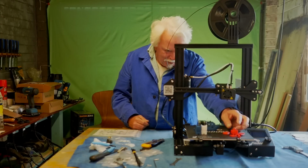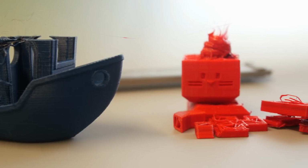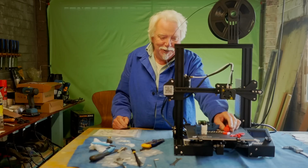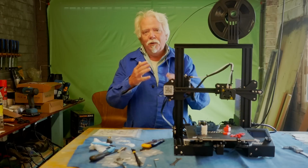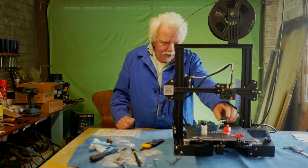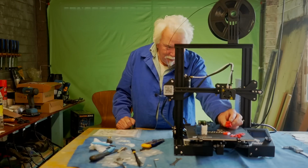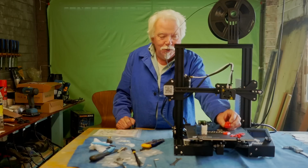I will. And then I got a bit silly, I guess, because some of that sample material I showed you isn't PLA, it's PETG, which I'm not even sure that the Ender 3 can print. I'm sure it can, but it's not one of the standard materials that pops up in the control panel. I definitely didn't have the settings right for this, because the layers weren't sticking together properly, and then it just went mental at the end with what seems to be a clogged nozzle.